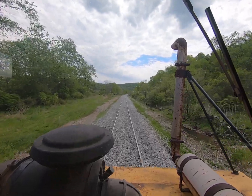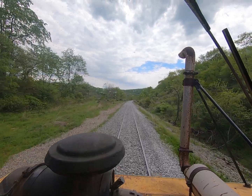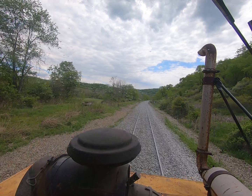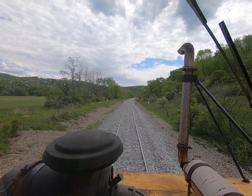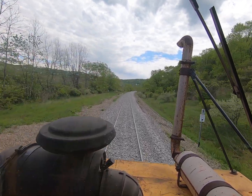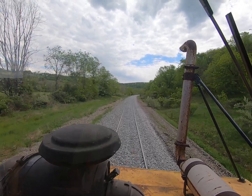This is railroad. This track is starting to look really nice. Next time I come up here, I'm going to line that little spot out there and tamp it maybe two more times. Keep picking it up. I want to pick it up about four inches from where it is now, and that'll be the final product.